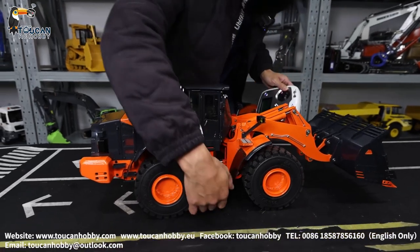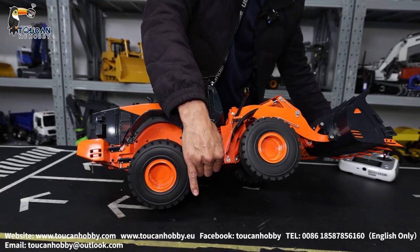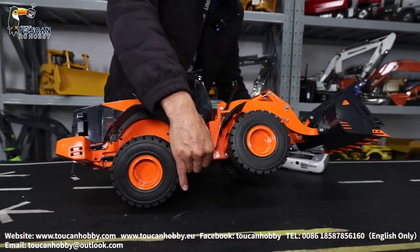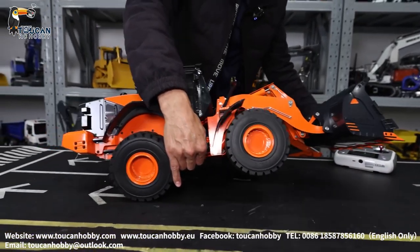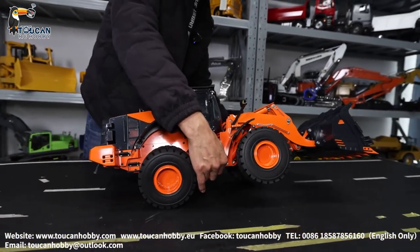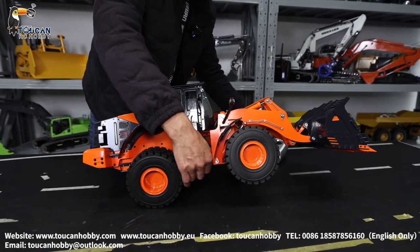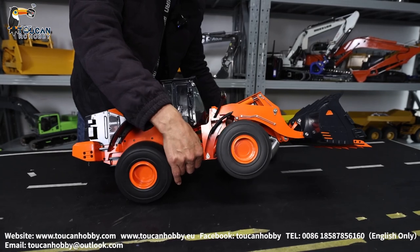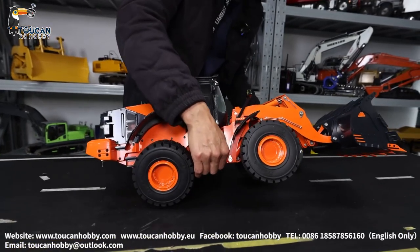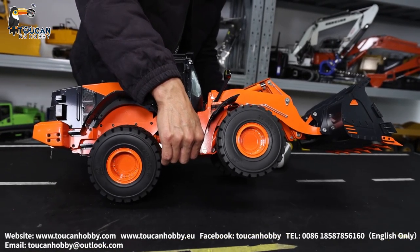Let's see the differential - turning it, lift up, go forward. That's the differential. And low speed - lock it. Now going, turning together. Go to high speed differential. Unlock it - now it is engaged. High speed, low speed, low speed with lock.